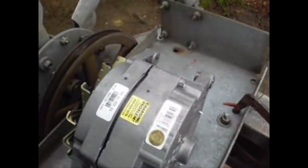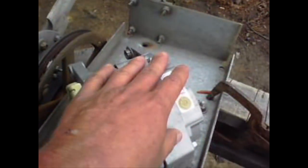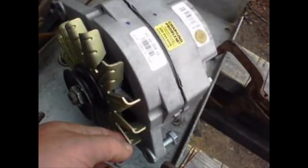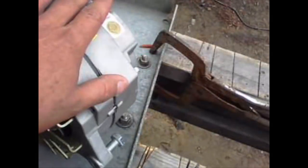So I had to go smaller. This is a 100 amp alternator, because it is a Honda and it turns counterclockwise. So I couldn't go with the clockwise Delco. But that's okay — even at 100 amp, that's pretty good.